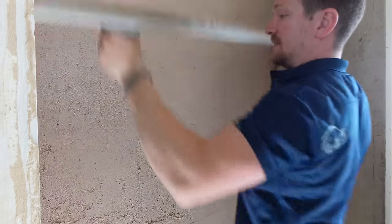The base coat is going to pull the moisture from the first layer of your finish and give it a stable background to work on. The second coat is your finishing coat almost — two layers of plaster, finished plaster. The first layer takes the battering from the base coat and the top layer is your nice aesthetic look. So now we're just going to apply the second coat the same as before — working left to right, take a small amount.